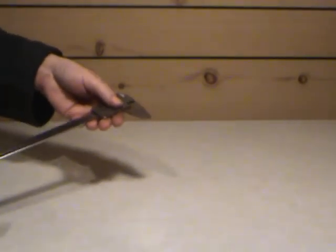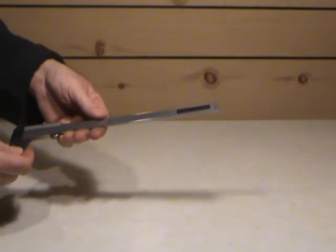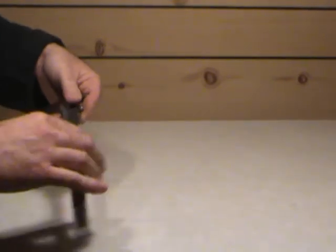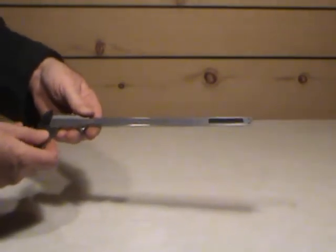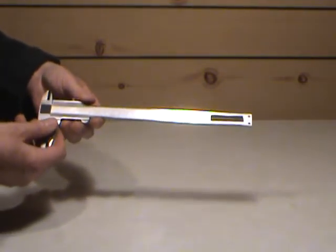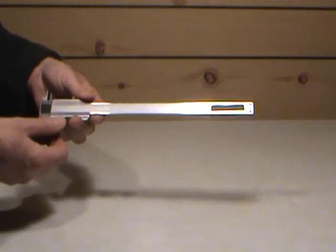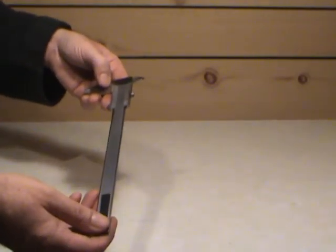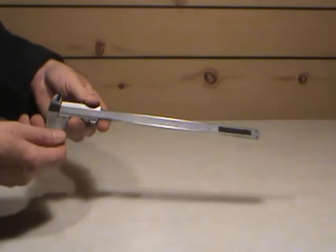For precision measuring — these are an older set of vernier calipers, good for eight-inch length or diameter. These ones are graduated in the imperial inch system, or the American inch system. Canada went metric in 1977, so you'd have to do a conversion if you get something metric. If you have an imported car they're all metric, but if you have something from the United States they're still in the inch system.